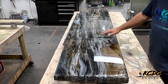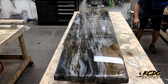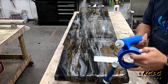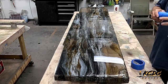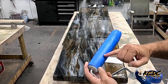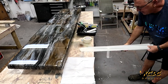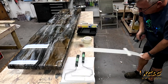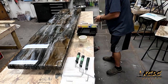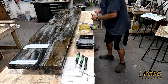I have the edges sanded. Now what I need to do is wipe this surface off and get all the debris off before I'm ready to apply the Ultimate Top Coat. I'm going to wipe the surface down with 91% isopropyl alcohol — I'm not going to oversaturate it, just wipe off any dust that has accumulated. After I wipe it down and run my hand over it, I can still feel little bits of debris. So that homemade lint roller is what I use to pick up any debris, because if I don't pick it up, it's going to end up on the surface and show through my Ultimate Top Coat. I want to make sure there's no dust, no debris, no lint, nothing on that surface — perfectly smooth, ready to cure and deliver.